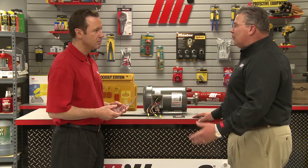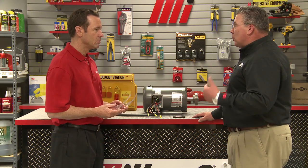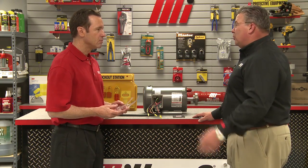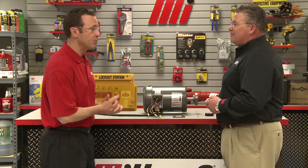Today we're going to review the procedures for a typical wiring of an alternating current, or AC, induction motor. Safety is our first concern. Before handling any wires we must double-check to be certain these wires are not live. This can be done by using a voltmeter. You should also be sure to use the typical lockout/tagout procedure, and we also need to have our PPE — personal protective equipment. Make sure you're wearing the right PPE for whatever job you're doing.